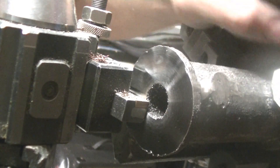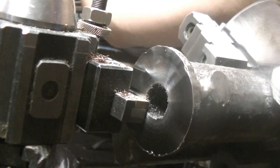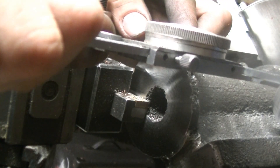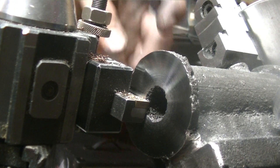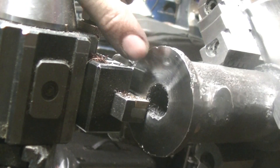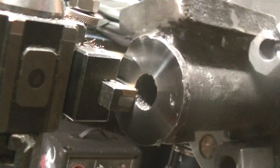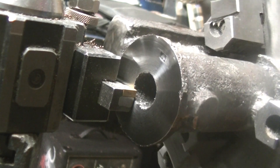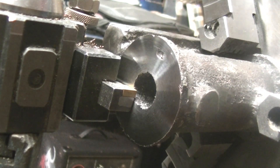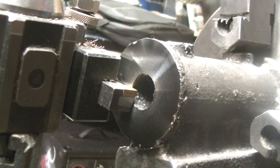It's getting a really nice finish. Damn, had to get that little inclusion. Well, I left it a little over a quarter inch - I'm 10 thou over. I'll try to get it down to a quarter inch on the nose and see if we can clean up that little inclusion right there. This inclusion is just gonna have to stay there. I think it'll be all right, but it looks like it's just gonna get worse the more I machine off.